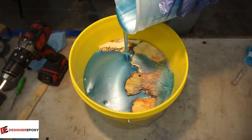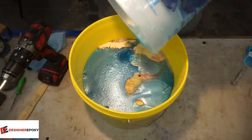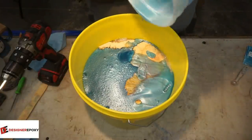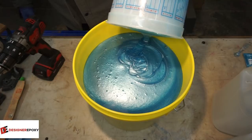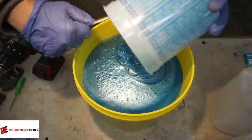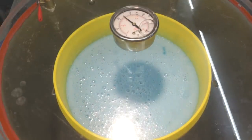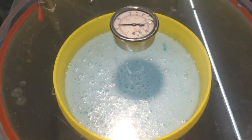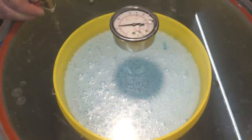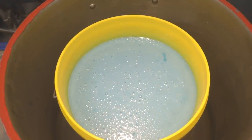You've got to use the deep cast when you're using this much resin. If you try to use pro series it's going to overheat and it's going to have a ton of issues, so deep cast for any of these deep castings - as the name says. I figured it was best to put this in the vacuum chamber and it always surprises me how much air comes out of this dried box elder burl. After an hour, let's get this in the pressure pot and we'll see you guys in 72 hours.